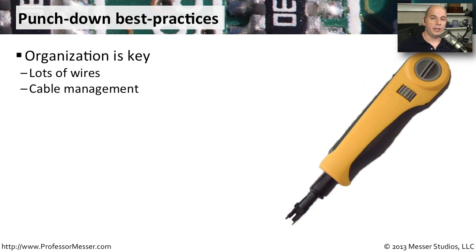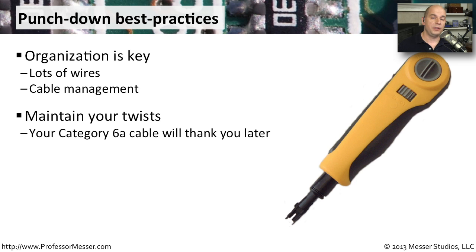If you're going to be doing a lot of punch-downs, you need to be very organized — there are a lot of wires, and you want to be sure you have them in exactly the right spot on that punch-down block. Make lots of notes and documentation so you know exactly where those cable drops are going. If your punch-downs are being used for network communication, be sure to maintain those twists. You can't untwist all the wires and expect maximum efficiency — at higher network speeds, keep those twists all the way up until the point where you have to punch them down.